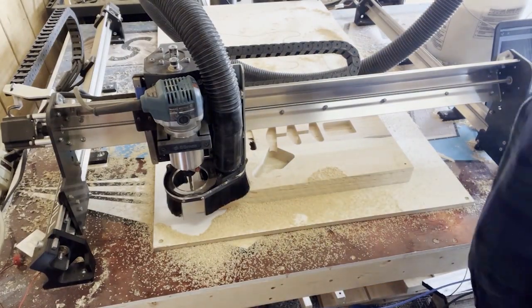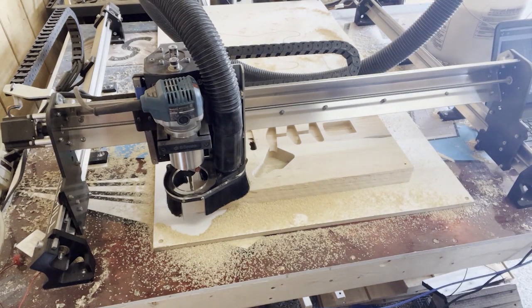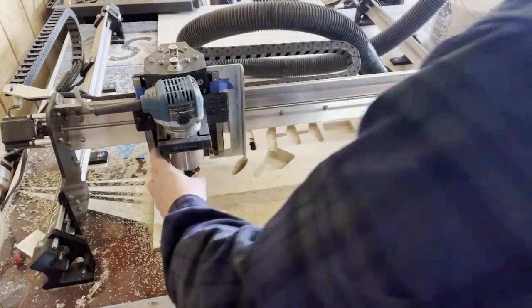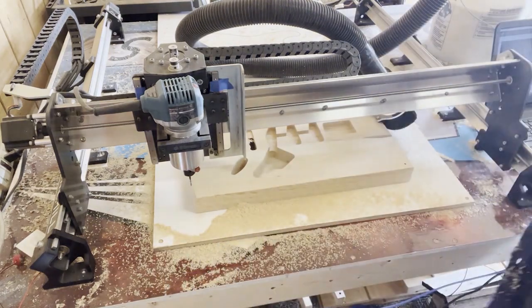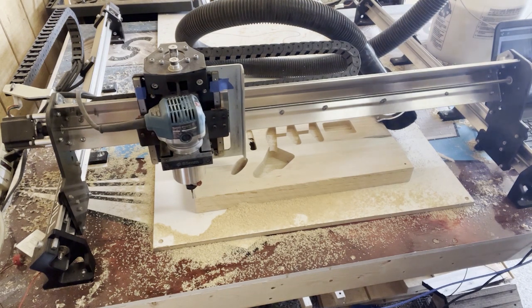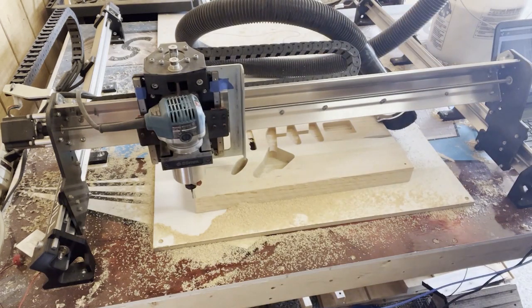Okay, so we finished our first cutout of the top, and so now we have to change the bit back out to the eighth inch ball nose so that we can do our arm contour finish. Okay, there we go. And then we once again lower that, should be good. Okay, and then we zero Z,